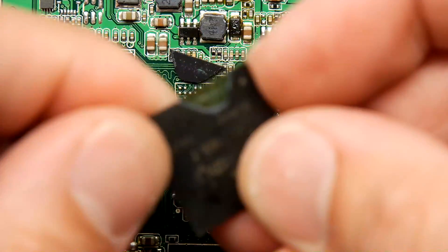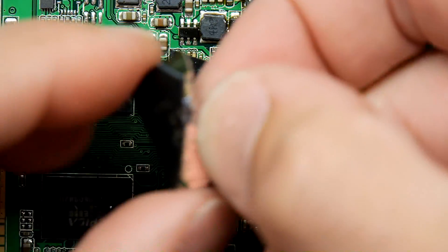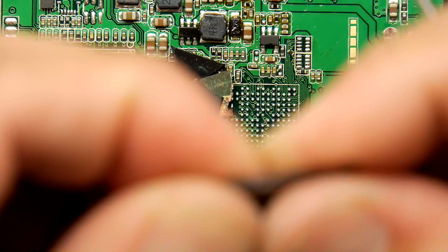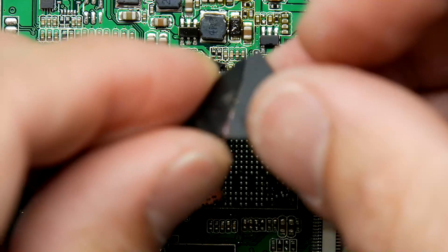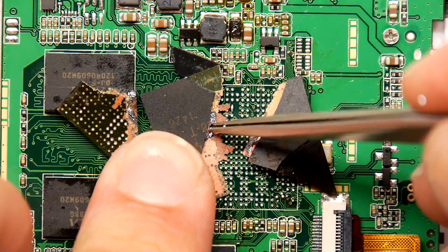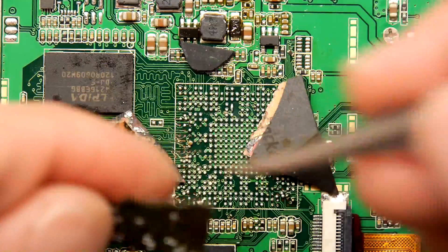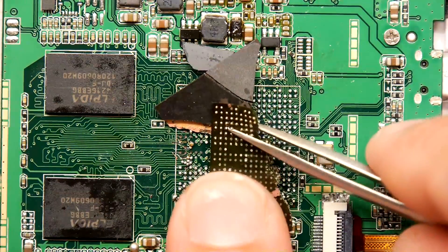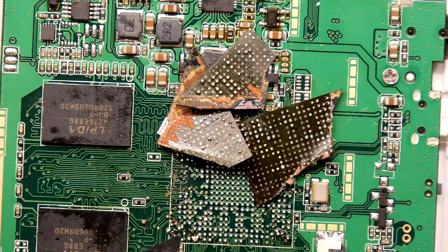Okay so we've got a chip off — we've taken a bit off. I can see the chip, I can see the silicon — oh there's a bit of it. You can just about catch the edge — do you see it right in there? The bit that looks like a piece of glass — that's probably as good as we're going to get. Maybe if we're lucky we can just crack this one open, peel it back. Yeah, so that bit of shininess in there is the actual bit that does all the work. You can see all of that big packaging is to do with dissipating heat and routing these contacts — the material itself bonded on the bottom of the chip is actually like a small PCB.